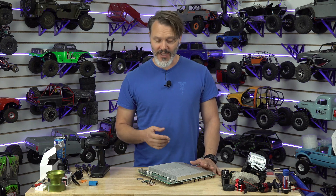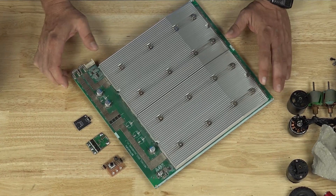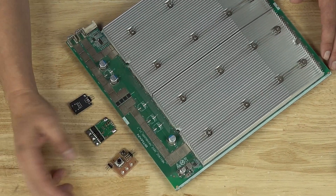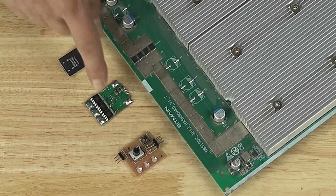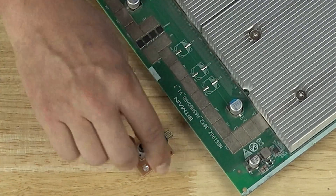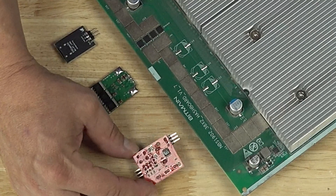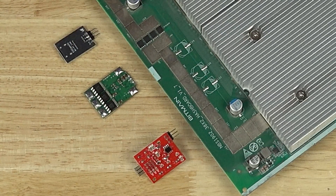The cameras were all tuned for green. These days we have regular vision cameras and AI learning type stuff that can work around colors, but the contrast was extremely important in the early days of automated manufacturing. Here's an oddball — it actually has no solder mask on this side of the board because they didn't spend the money to put one there. This one is actually a red solder mask. You can have about any color of mask: red, purple, black, green, blue — really any color you want these days.